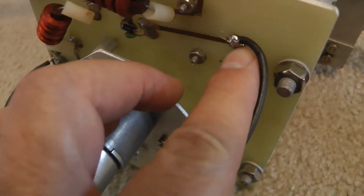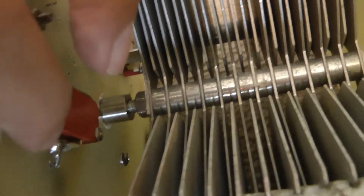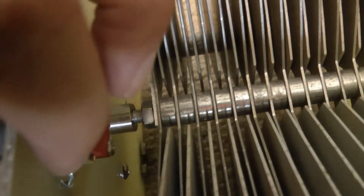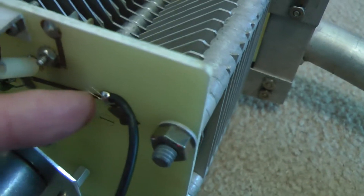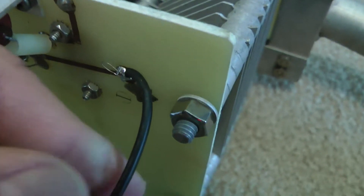Something I thought — I'll just unsolder that. Well, something I learned is you first unsolder it from the switch here, heat it up and you have one of those solder suckers so you can just pop it on there and suck all the solder off. Then you go through here and on this one, you heat it up and then you're able to pull the wire out, and the same thing goes over here.